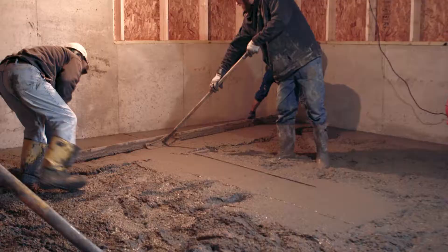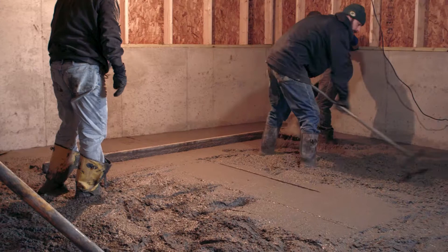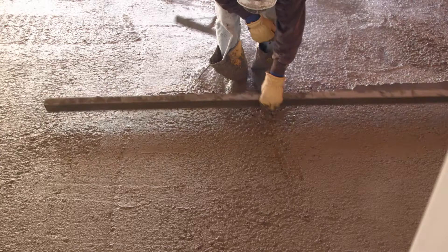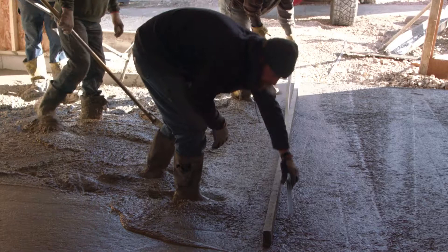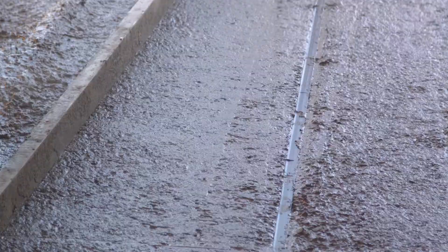Screed — what a fun word. A wet screed is created in two ways: one is by using a hand float to smooth the concrete at the chalk lines, and the other is done by leveling small areas with your story stick and then using a 2x4 or an aluminum strike off to create a long, flat area at the proper height. Now you can strike off the concrete to proper height by spanning the two wet screeds. A zip strip is a T-shaped piece of plastic placed in the wet concrete while it is being leveled. Generally, we want the zip strip placed every 12 feet or so, and ideally at any corners of the foundation wall. The top of the plastic strip is removed, leaving the piece that will eventually make the concrete crack in a straight line — and the zip strip will never be seen or heard from again, just like many former members of the mafia.